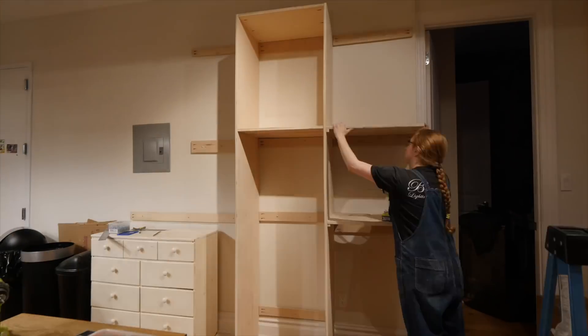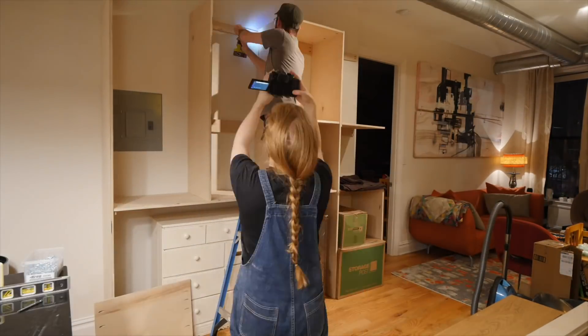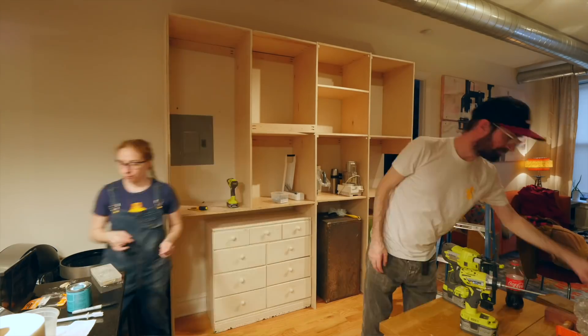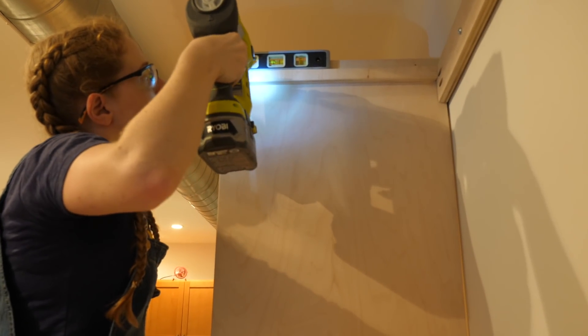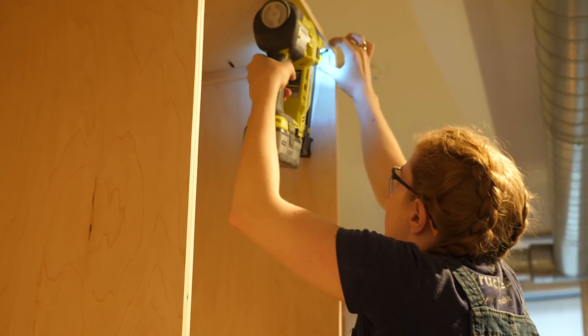Together, Smokey and I installed the remaining uprights, nailers, and primary shelves. Since we were renting, we didn't use glue to join any of the perpendicular pieces, so it can be disassembled easily if needed. We did glue and brad nail in some shelf supports on the uprights to provide more structure, but the shelves just rest on them, in addition to having those pocket hole screws.